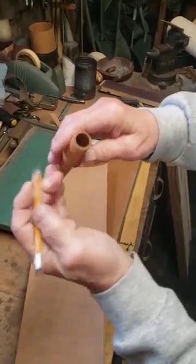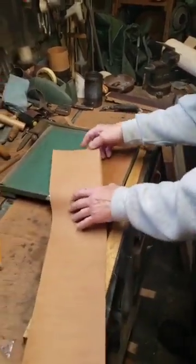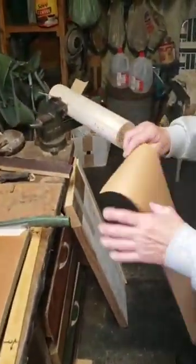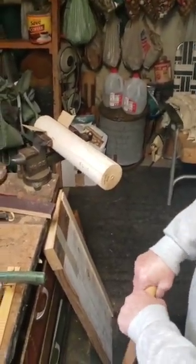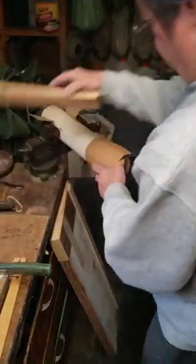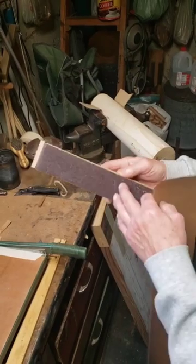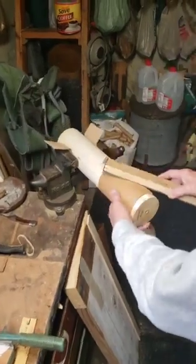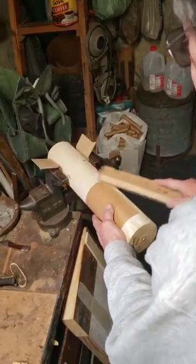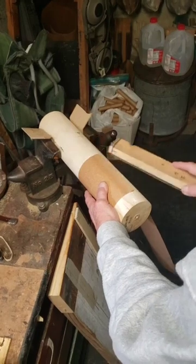If they were overlapped a little bit, that wouldn't matter because they're both tapered. And if you get the taper just right, you shouldn't have any bump right there. Here's how I do that. I've got a piece of white ash wood right there, and I like to put a little curvature in the paper and put it down here. Here's 80-grit emery paper — pretty heavy duty stuff, mounted on a stick. What I do here is taper that about three-eighths to a half inch.